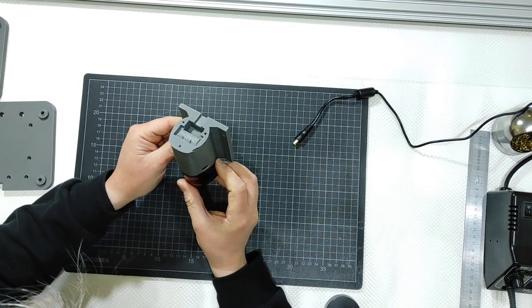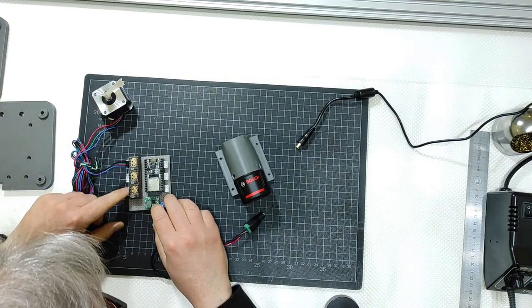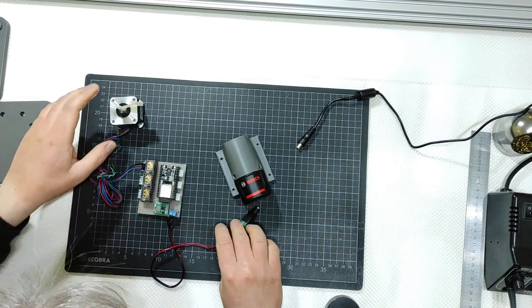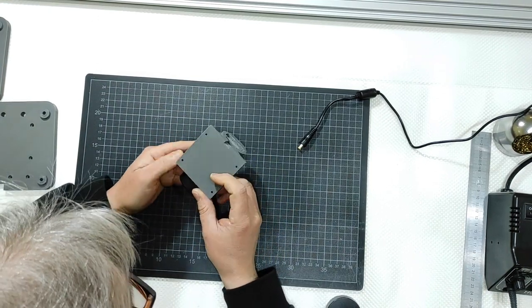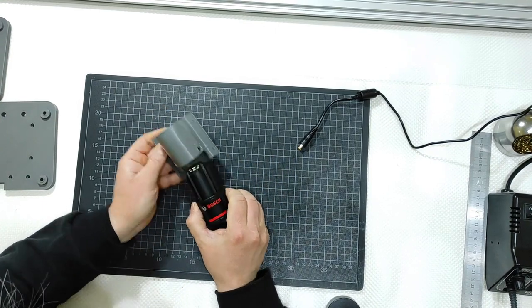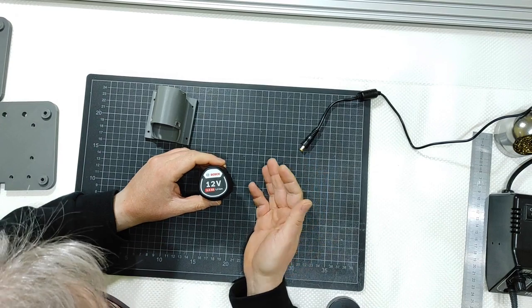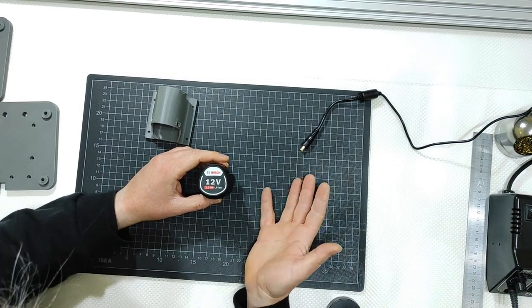This is shaped to get like that, okay? This means that the whole system works with 12 volts: the stepper drivers need 12 volts to get the motors working, but the ESP32 brain needs just 5 volts to work, so I also needed to power it in an alternative way from the 12 volts. And this battery is what I will use to power my system and get it cordless. This will be a cordless system. If I got the calculation right, this should be enough to work around 1 hour on battery. Of course, if you have a 2.5 amp hour or 3 amp hour battery, the working time will be longer. Or if you have a 1.5 amp hour, it will be less.